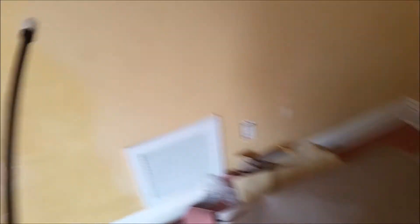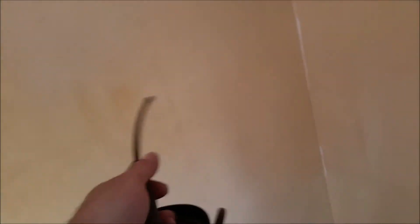Then what you do is get your sprayer — a Hudson sprayer or anything — and you spray the wall really good. Go over, spray it, and when you are done with a spot, come back to what you first sprayed. Basically, this is an underlayment of paper that has to come off. You can do this right on the wallpaper if you want, before they pull it off.